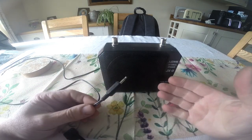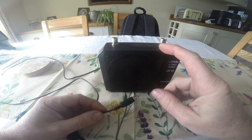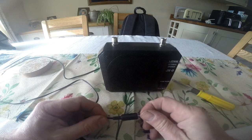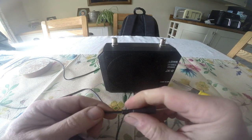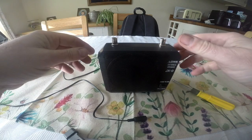This is a great piece of kit — it's called an audio load. It's got to be an 8 ohm speaker; no other impedance will do, it must be 8 ohm, that's the important bit. If you're missing the 3.5mm jack plug you can buy those separately and wire them up, then two BNC connectors and that's all you need.